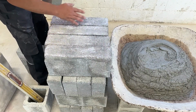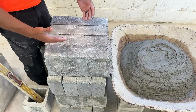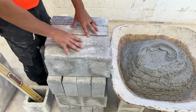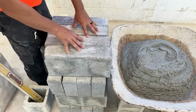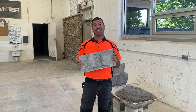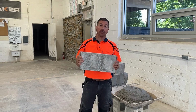There's many other types of 4-inch block. That's all that I have on hand right now. They have tile face block, fluted block, different colors, different types of 4-inch block. These are solid. That's going to give us an indication on how we should spread mortar for this project. And I'll go over that in a little bit. We're going to need to cut this block in half so that we have enough halves to build the project. We're going to go do that on the wet saw.